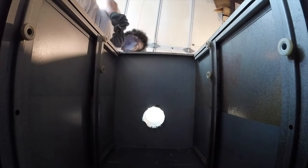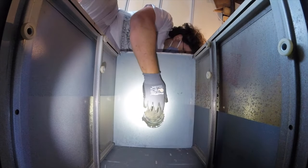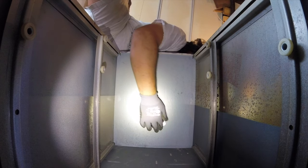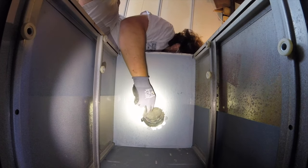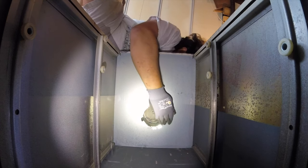I want to show you something here, so give us a moment to get the camera set up right with a light source. This flange needs to be mechanically stable, so these little fingers on the bottom need to be folded directly all the way so that they're as flush as possible with the underside of the metal piece here. The metal piece being the top of the filing cabinet. Still get a kick out of saying that.